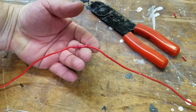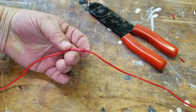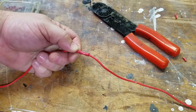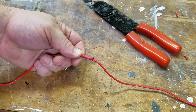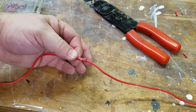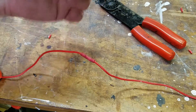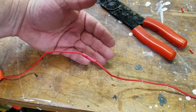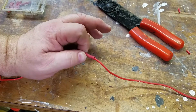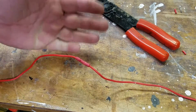That's not going to come loose. Out of first-hand experience in my first career as a mechanic, I saw a lot of cars that had those twist and tape joints, and they had a lot of fires involved in them. Please don't ever use those. Always, at the very least, use a butt splice connector like this, or solder and tape your joint. Now that I've got the joint made, you can do an extra layer of protection and put tape on here, but this is just for a demo so I'm not going to do it.